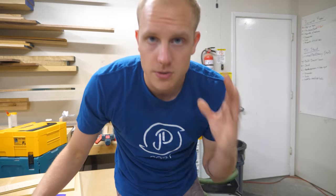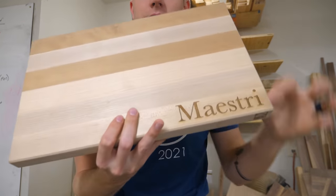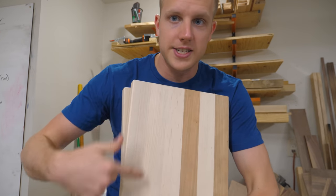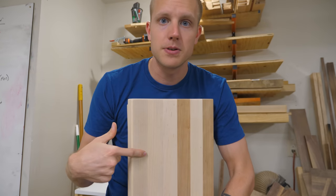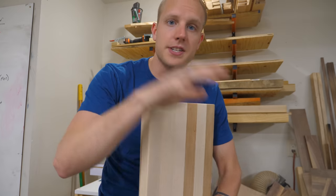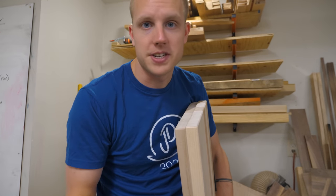Every so often in our cutting and charcuterie board business we get boards that have a bad engraving on them. These two boards with bad engravings — we're going to run them through the drum sander, and that's going to leave really streaky sand lines. That's what we struggle with the most in sanding — it's the most labor-intensive thing we do for these cutting boards. The faster I can sand these and get them smooth, the less money we're wasting in labor. So this will be a really good test of whether there's an appreciable difference between the Abranet pads and these new 3M pads — totally unscientific, but you can triangulate your needs based off of this.